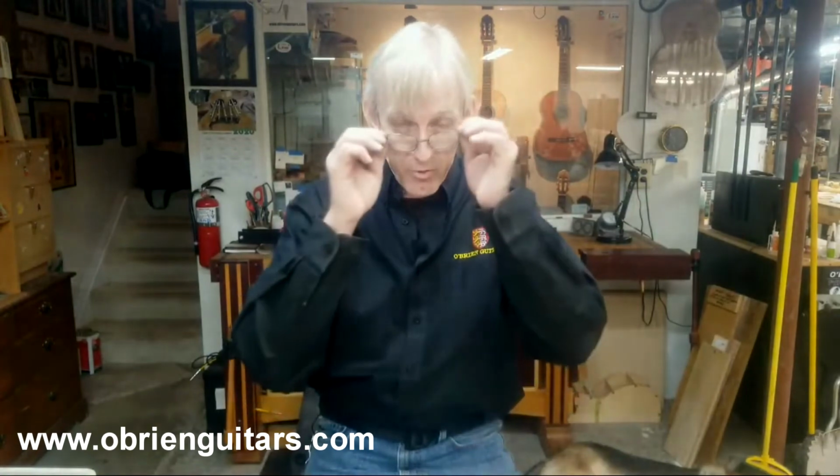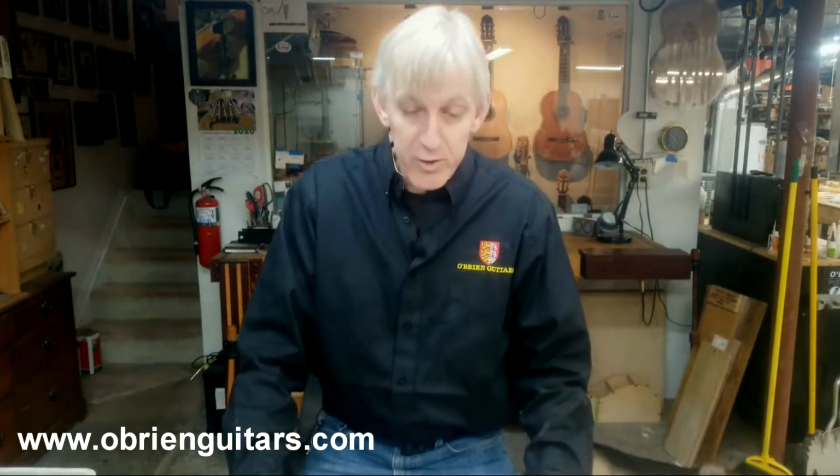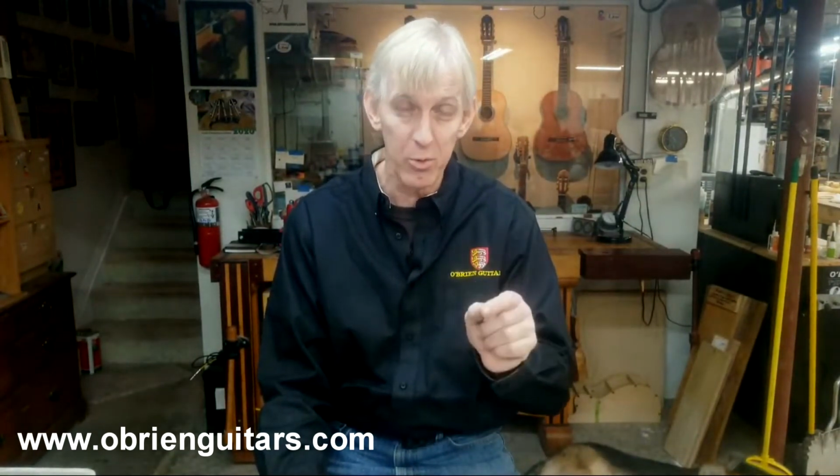So let's recap what we've done here, folks. I've introduced to you my sharpening station here. I've talked about the diamond stones. I've talked about the water stones. You need to flatten those water stones. Do it periodically throughout your sharpening process. Make sure that they stay flat. Very important with water stones.